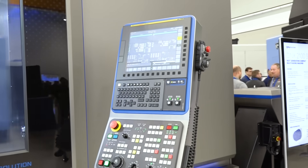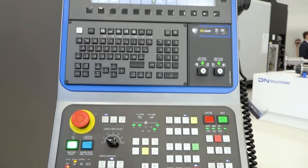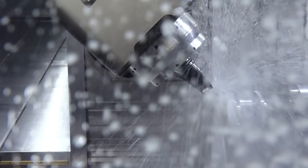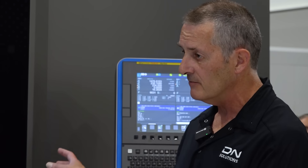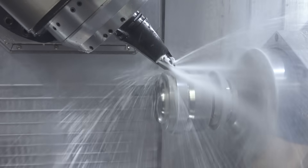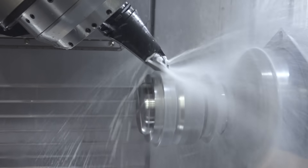Where does Mill-Turn technology thrive in machine shops today? Job shops, short-run parts, one-off. There are a lot of parts that require high tolerance and coordination between all the features. When you're passing between two machines — taking it off with a robot, bringing it to another machine — you're losing some of your tolerance. You have to fixture, make special fixtures to locate the part. This machine does everything from start to finish. You can access pretty much any feature on the part with the Y-axis, turn in any direction, transfer from one spindle to another, machining left and right sides, and it never loses its orientation between the two. You're making a complete part without any flaws or realignments required.